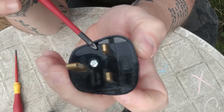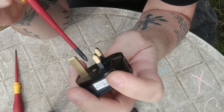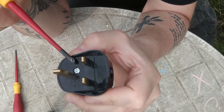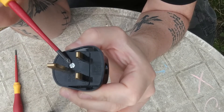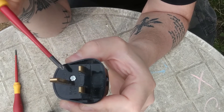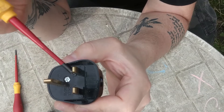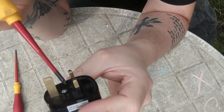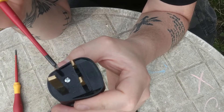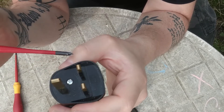As you can see, this one is a 13A — it comes with a 13A. With these ones, you don't necessarily have to stick to the 13A; that's actually the maximum this plug can take. You should consult the manufacturer's instructions on what fuse size you need. I've seen a lot of times people just use the one that comes with it, when they actually need to downgrade it — take it out and put a smaller one.